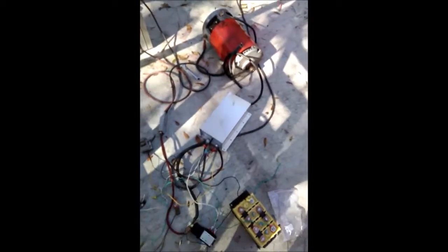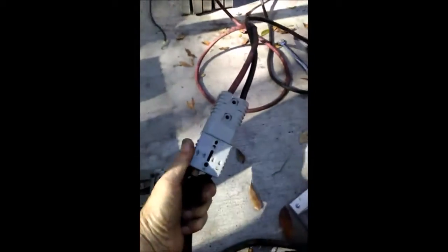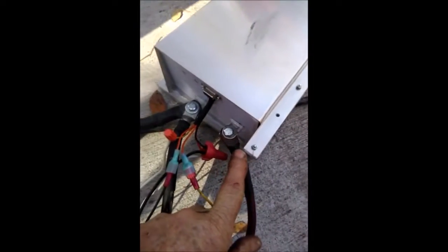This is the open source controller and I have a small battery pack of about 30 volts. My emergency disconnect has the plus coming up to the plus side of the contactor. The other side of the contactor goes to the plus on the controller, which also goes out to the motor. This wire goes to the motor armature, and this wire goes to the high voltage negative.